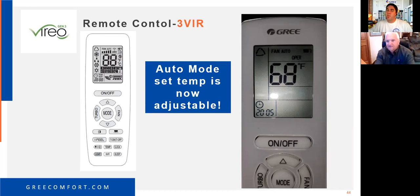For the most part, all of the controls are the same. I've checked it with some other model indoor units. This remote will control those, just as we tell everyone. There was only one model that didn't work with all the others, but they'll control any indoor unit. The only caveat is that some of the features and benefits of this remote and the 3VIR just won't work on the other models. Such as the auto mode.